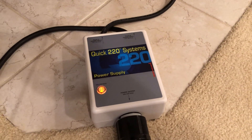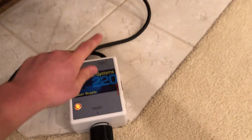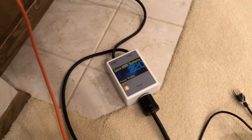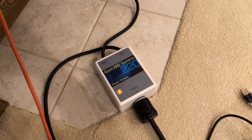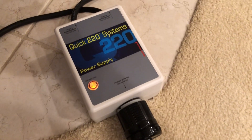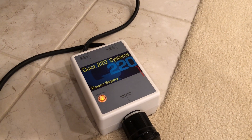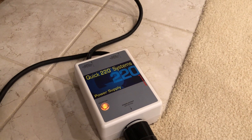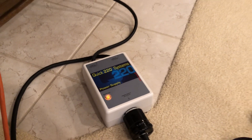Really simple device. You just have two input leads on here. One goes to a 120 volt socket, the other one goes to another 120 volt socket, but it has to be on a separate phase in your house. The electricity coming into your home is actually 220 volts, but the two different phases get separated out into 120s combined with the neutral.